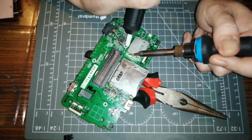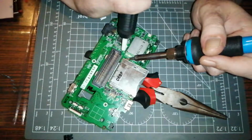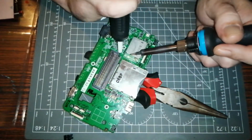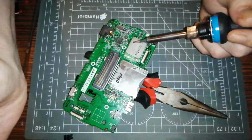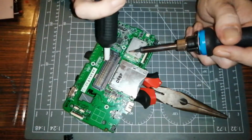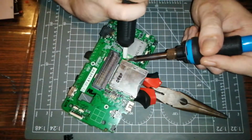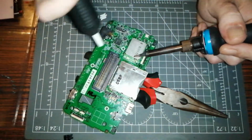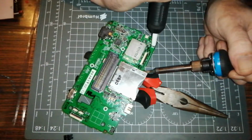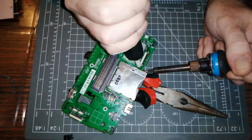The part I was getting to was, ideally, remove all the solder would be great, but plan A is to just remove as much as we can, so when we come back round again with a scalpel, at the same time, solder that in, we can pry it kind of loose, and that should separate it until the solder sets and job's a good one. We'll have the separation that we need that would otherwise not have occurred without us messing with the prying thing.